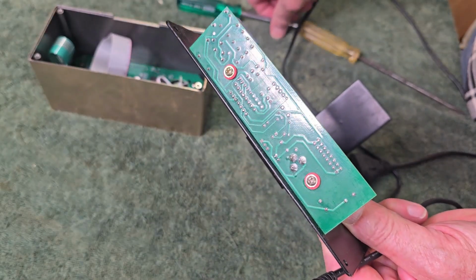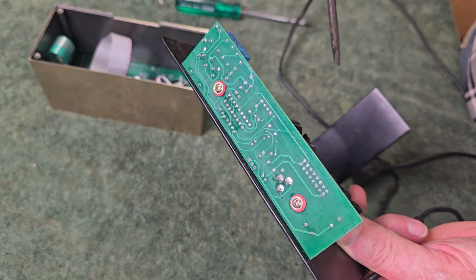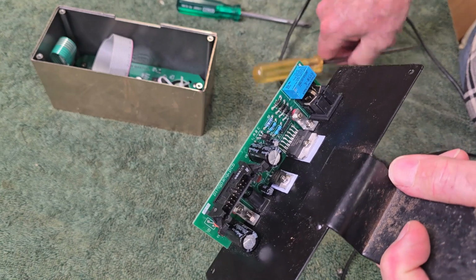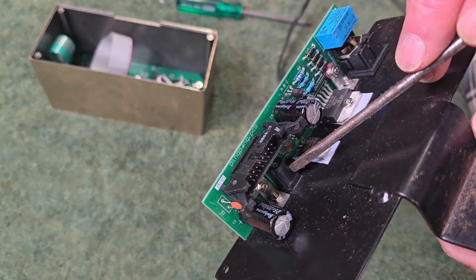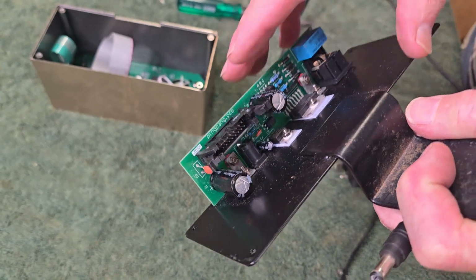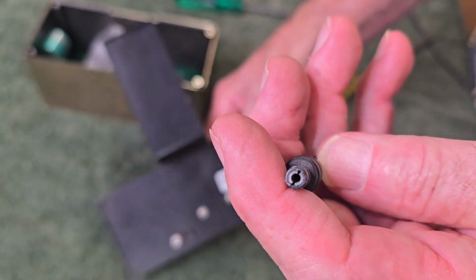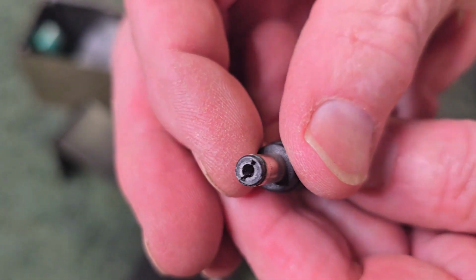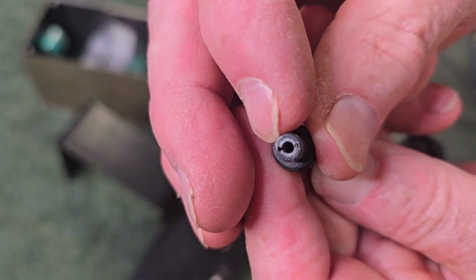So I've just had a close look at this, and I don't actually think the terminals are cracked. They look okay. The body of the socket has a very light crack in the case, allowing it to flex a little bit, but that's not the main problem. The main problem is actually corrosion in the end of this plug. If we can get a close-up without losing focus, it's certainly been in unfavourable conditions. It looks okay on the outside, but it's a bit corroded in there.